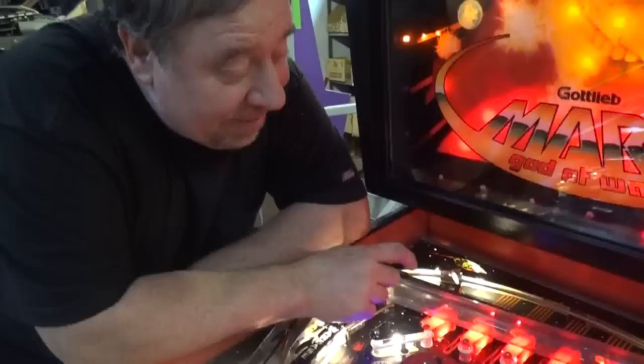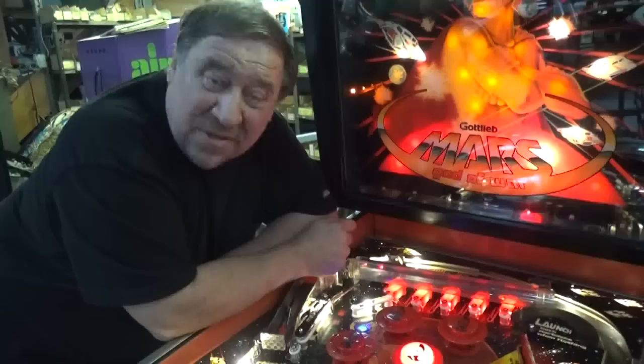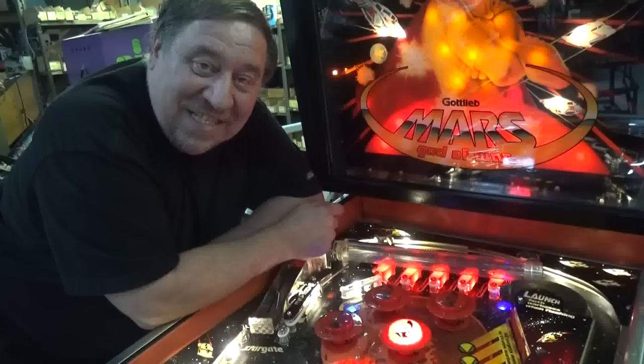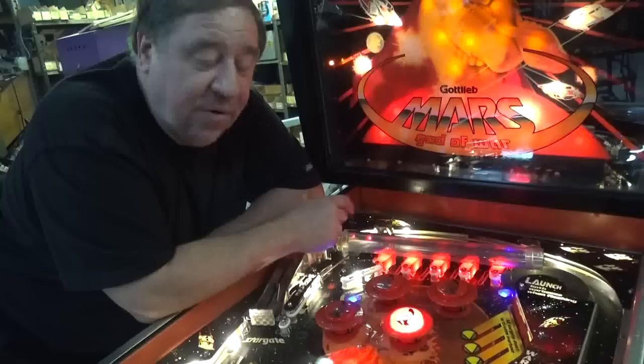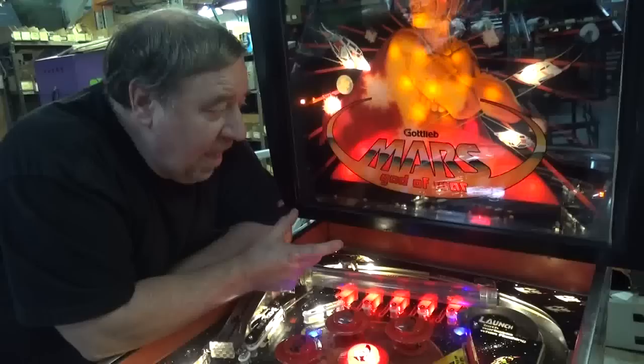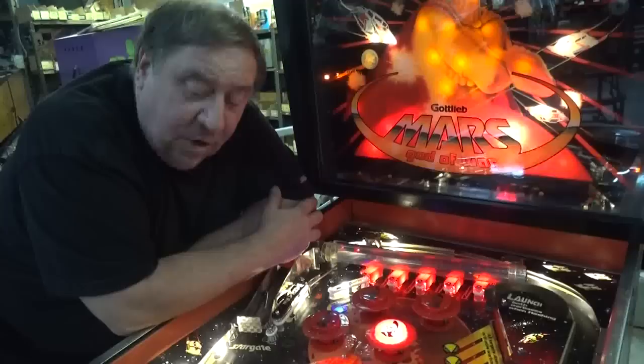Look - our tube from Xenon. Yeah, Xenon, that same tube - almost, but it's a lot longer. It's lit by LEDs behind. LEDs have been with us all these years but we never really used them - they were a lot dimmer, too. These are the original LEDs, they've never been changed, so they really do last a long time. There is one of those little animator boards in the bottom that runs the LEDs, so they're not running off the computer - they have their own board. Gottlieb loves using those animator boards. By changing the resistor value, you can change the speed of the flashing, so you can use them in different parts of the game.